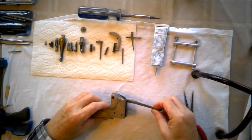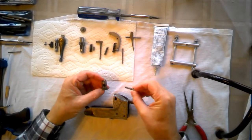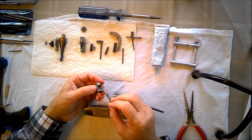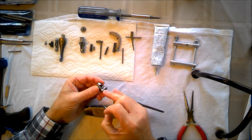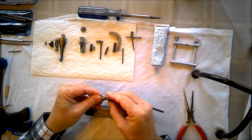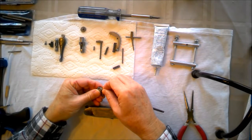But to begin with, let's start with the way this mechanism is going to work for the top lever. That's going to be very important. One of the things you'll do if you're disassembling this is make sure you get this in order. You'll first notice that this is the cam and it's grooved out, and you'll also notice that the screw is grooved out. When this is assembled in, then against the top lever, your top lever spring post is going to be setting down in there in that groove on the screw.